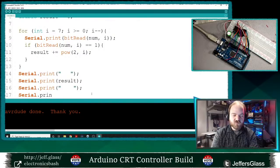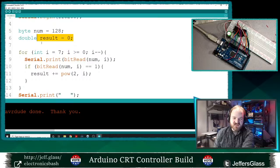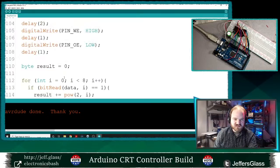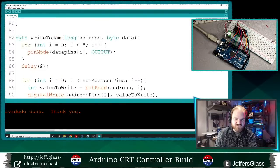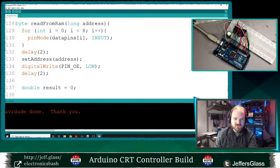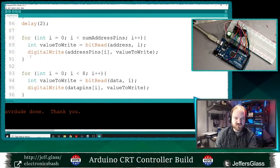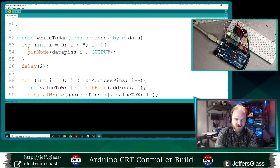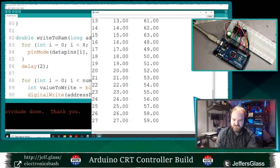And we will say serial. So I think what is happening is when that result is an integer, it is being rounded slightly at each of these steps, which is causing inaccurate results. Especially if it's a byte. So I'm going to say in each of these cases that the result that we're calculating for the time being, and this is going to throw some things off, should be a double, which is a kind of floating point, a decimal number. That's not really what I want to do, but since all we're doing with that value currently is printing it, I think this will be illustrative.